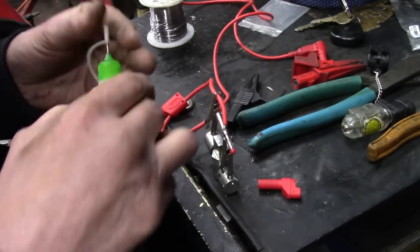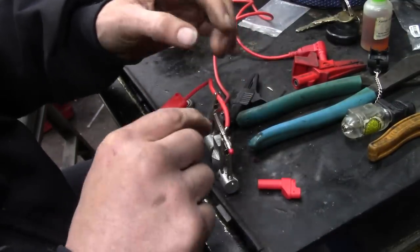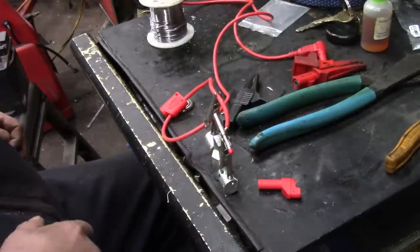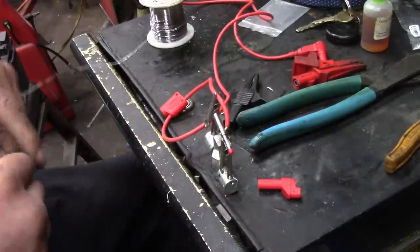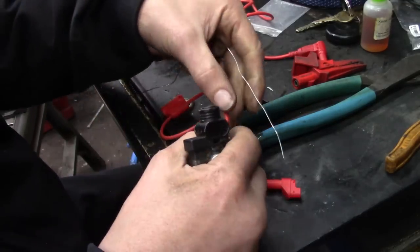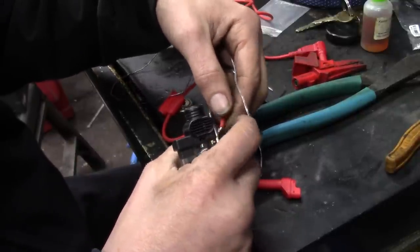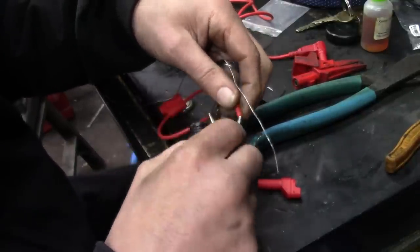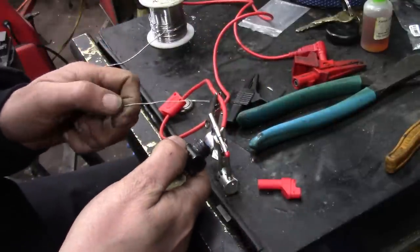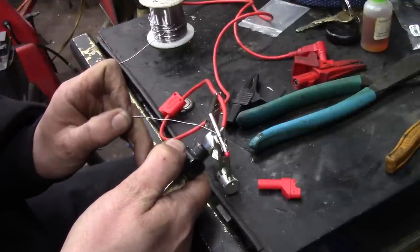The reason I try to hold these sideways is so that the solder doesn't run out of the bottom hole while you're soldering. If that happens, you're going to have a really hard time trying to put it in, or you'll have to spend time cleaning it up - which you can avoid by doing this. Take your time; the first couple are not hard to do, there's no need to rush it though. It's simple enough.